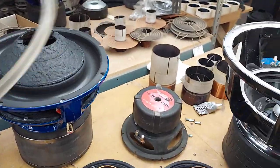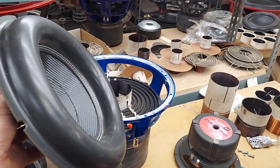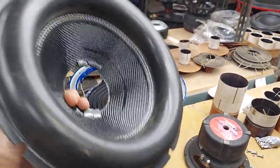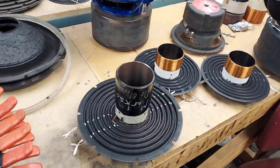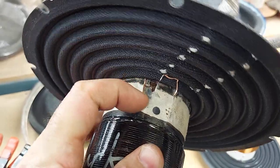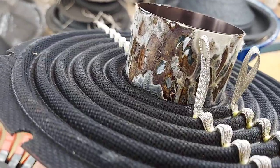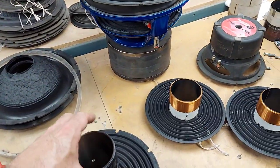I forgot I was going to use the Gonzo cones. This is the dual 0.25 ohm, so in series that ends up being half an ohm, and then there's going to be two of them, so that's one ohm. I've got these coming in 12s and 15s — I think I've got 50 or 100 coming. ZV5 recone — have to recycle the coil, it's a really long coil. Looks like copper tabs, and what you do is you solder to this part, then drill up, so you have a real copper wire going to the tinsel on top. Then you just encapsulate the whole thing with epoxy and it's good as new.